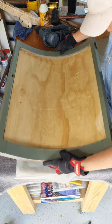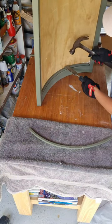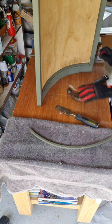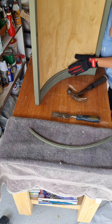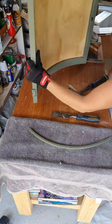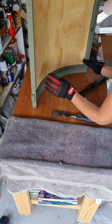So I popped the panel out, and I used some liquid nails to try and hold it back in, but even then it still wouldn't hold into place and it just popped back out. I think where I must have gone wrong with the one that failed is that I had my panel about 1 or 2 mil too big for the door frame, so it wouldn't really stay into place and that's where it was popping out.